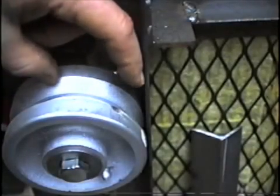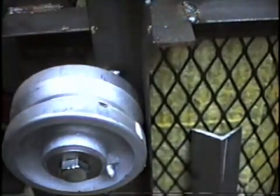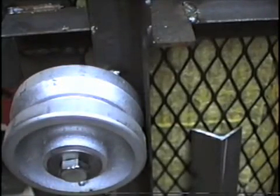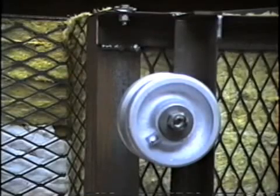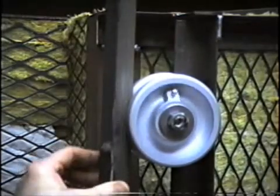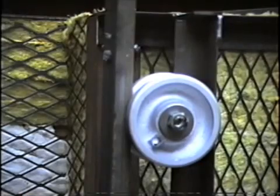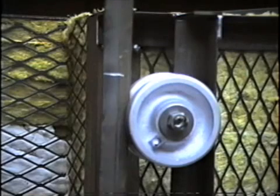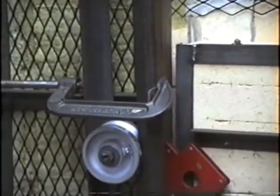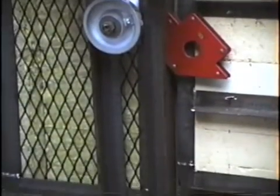Making those mounting bracket nuts 2 inches away from the steel gives me just enough clearance so the roller doesn't rub. Now it's time to work on the roller track. This is how the roller track will mount and this will be the roller action. I'm going to cut this above the top roller and then mount these pieces onto the door frame. I've clamped these rails against the rollers and at the bottom I put a little nut in there as a spacer to hold the bottom of the track about three-quarters of an inch off the base of the furnace frame.